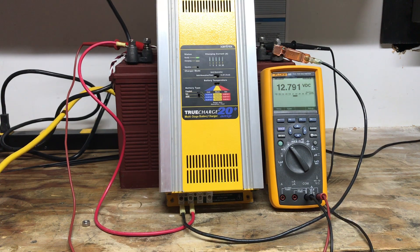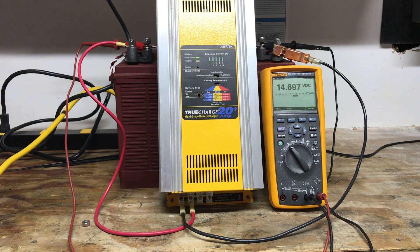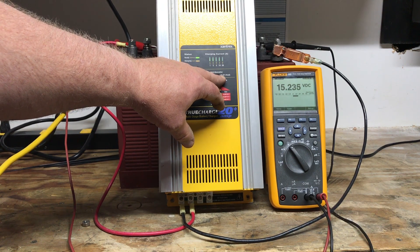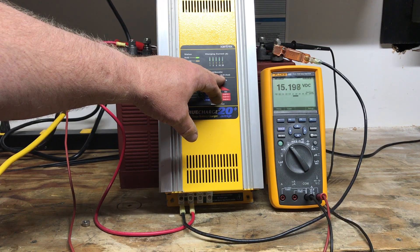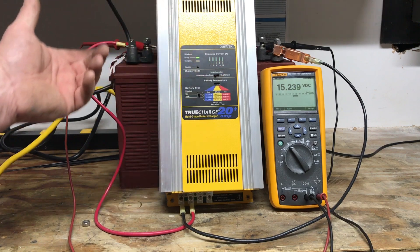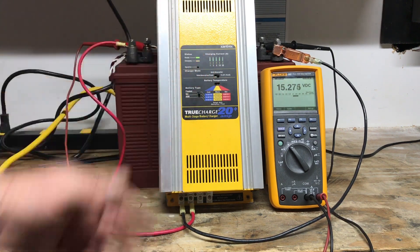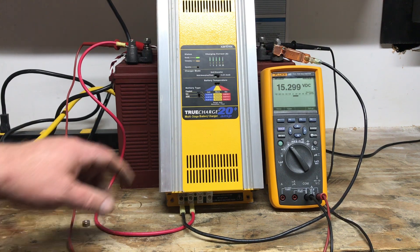I'm going to flip the charger on now just to give you an idea of what's happening. We've got a fairly full Trojan flooded battery in the shop that's ready to be equalized, so I don't mind using it for illustrative purposes. It'll be very difficult to see in the video, but I have this set to 13.5 volts fixed — this charger had a dockside mode where you could put it in a force float, which would prevent it from going in and out of absorption every time a fridge kicked on. No matter what I do, switching these switches around doesn't seem to do anything. The battery is just being pushed to a voltage above 15 volts, and right now this is about as high as it's going to go — but it'll keep climbing.